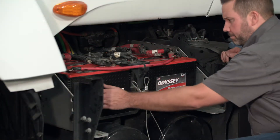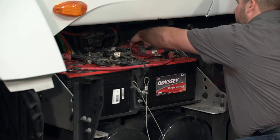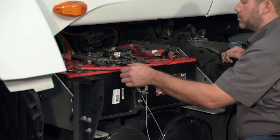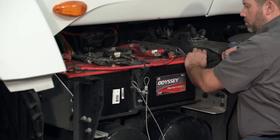Take a look around. Look for swelling or cracks of any kind. If you see any of these signs, go ahead and remove them for further inspection. Another item to check for is assuring that the hold down has been properly installed and is securing the batteries correctly and evenly. Any movement of the battery while in operation could cause an early failure.